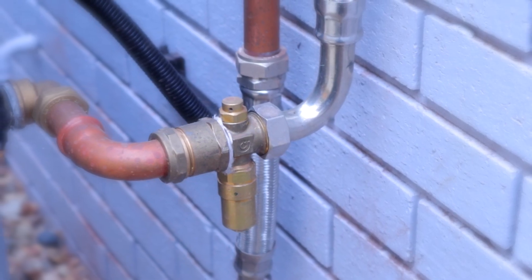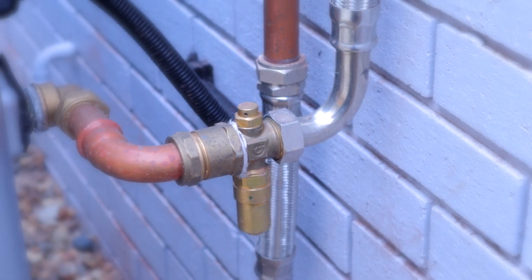We don't like to use glycol so we use the antifreeze valves instead. The antifreeze valves fit outside next to our unit at the lowest point — the lowest pipe point you've got outside next to the outdoor unit. The antifreeze valve itself opens when the water temperature gets to 3 degrees, and when the water temperature rises to 4 degrees it will shut, letting that water out and stopping that freeze happening inside the system itself.